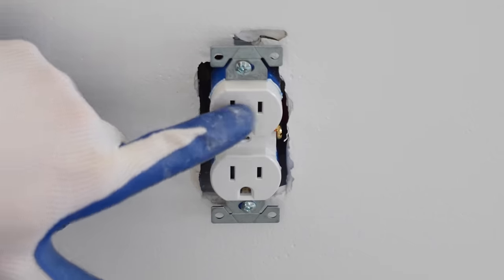For all the round electrical boxes, I'm just going to place covers over them for now. And I'm going to tie together the black and white wires using these Wago lever nuts. These are the 221s, and these are very nice because if you pull them open, your wire will go down in here, and then you just use the lever to clamp it shut, and it locks the wire into here. And the reason why I'm going to tie all my blacks and whites together is so when I jump out of a round box, I'll have power there in order to power a light onto a switch.